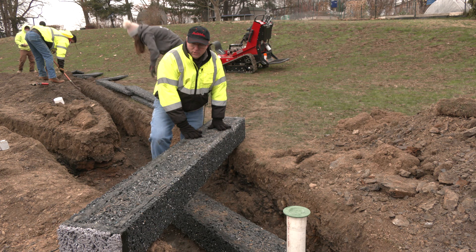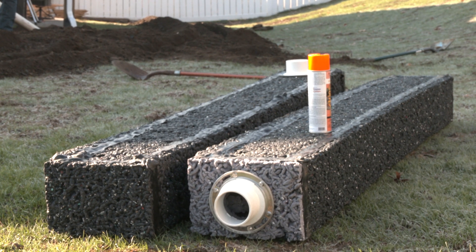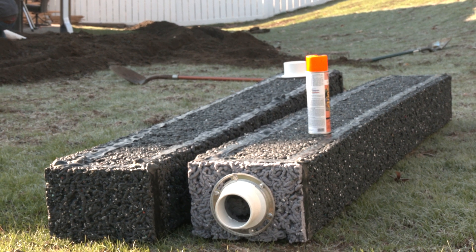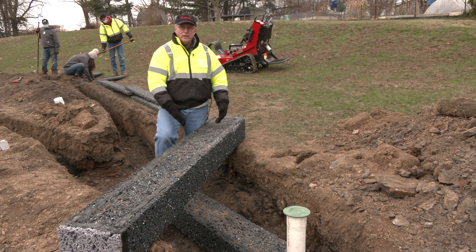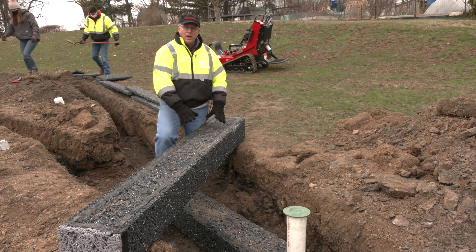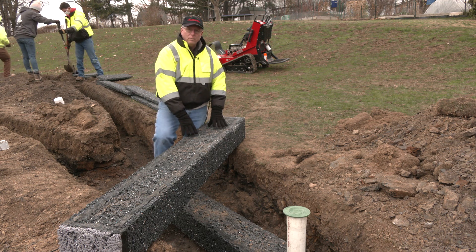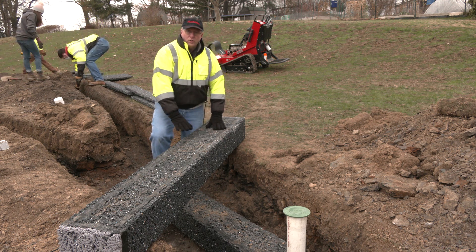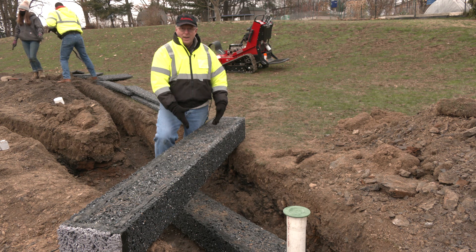The HydroBlock boxes are the stormwater boxes themselves. Manufacturing-wise, we're taking four of the boards and we weld these — we plastic-extrusion weld them together, so you still have a lot of strength to it. People that try and just glue them together really don't have the strength. They have to be plastic-welded together for strength, and also to keep the dirt out of the box itself. Now these boxes are hollow and will hold approximately 73 gallons of water, and they have strong structural integrity so you're not going to damage the boxes. Stormwater boxes are made to collect and hold water.